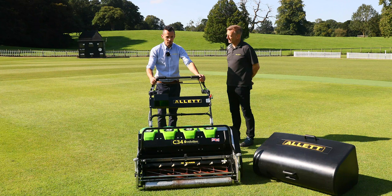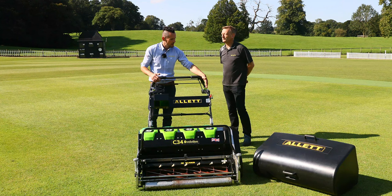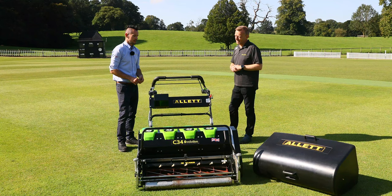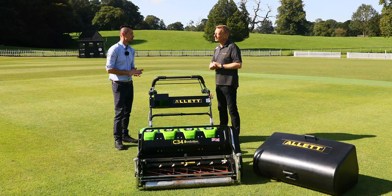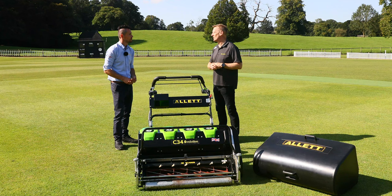Once you're back on your straight again, press that button and it picks up your previous speed setting and keeps your clip rate exactly the same. Whereas if you were adjusting the lever, trying to get that back in the exact same spot, it's very difficult — you'd never achieve that. I can see that when I'm turning around, I need a little bit of time just to be able to do that. It increases the productivity as well — it's just a very simple action, just pressing that button in rather than trying to slow down, make the manoeuvre and then pick back up. You set the machine for mowing speed for maximum productivity and the best clip rate, but you can still just slow down for the turn at the end.